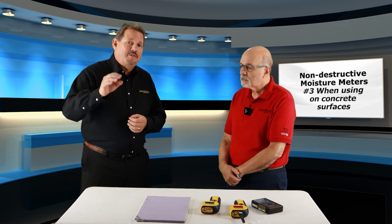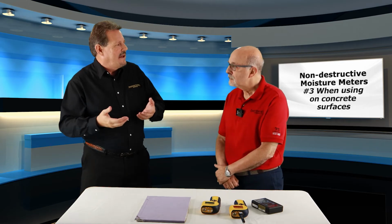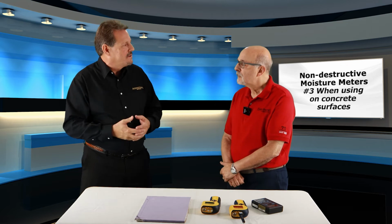Now, that's not an ASTM standard test, as it doesn't give you the moisture content of the concrete, but it is a comparative standard to other concretes. And one of the things I've always been taught about this is that when we have multiple different pours of concrete and ages of concrete, I was always told it greatly affects the meter, but I understand now not as greatly, but we need to be concerned with that.